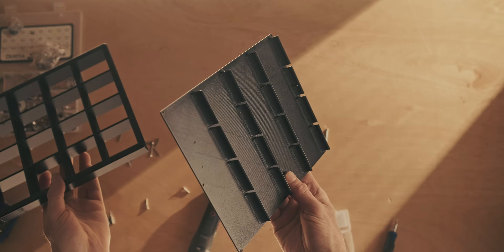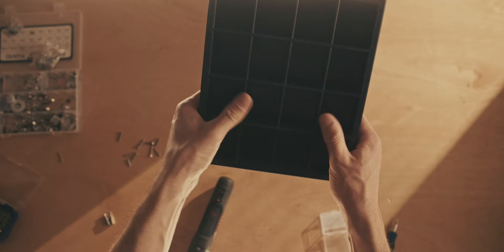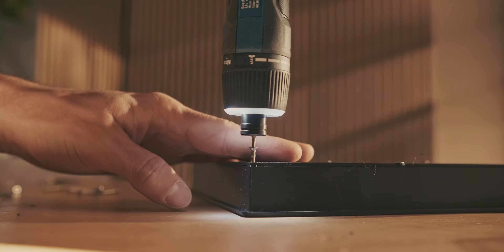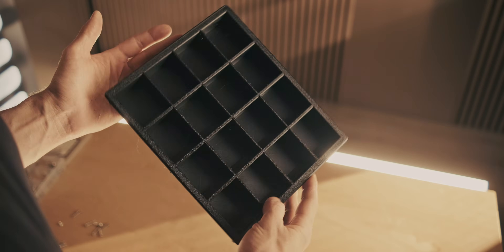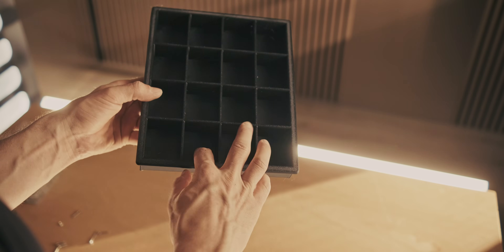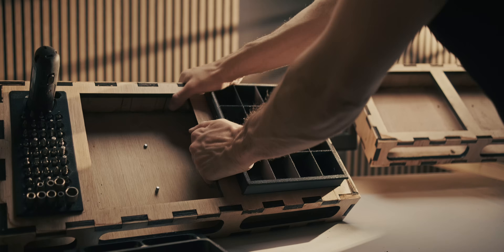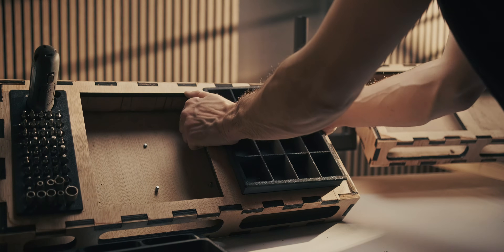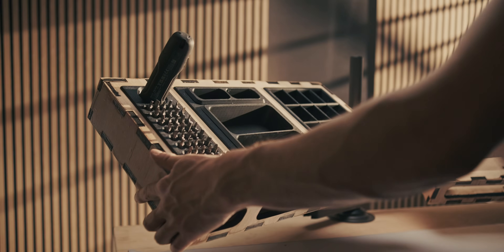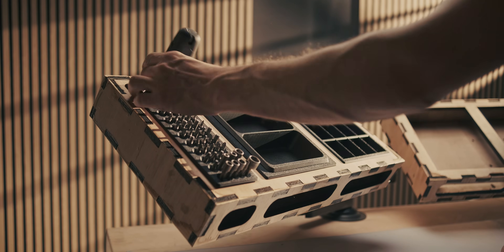Two components: a bottom plate and a top plate. The bottom plate actually accounts for a round-over so you can grab the bolts a little bit easier. In hindsight, it might also have been worth it to mark all of the drawers — drawer one, two, three, four, and so on — so that we can remember which bolts came from which component. But we'll see how this works out, and if it doesn't we can always re-utilise it for something different. For this last panel, I also increased the width of all the edges so that it would be friction fit in the design itself, because most of these panels aren't held in place by anything. I thought I'd use glue, but then you can't replace them easily, so friction fit works out quite nicely — and I'm going to do this for all of the other panels going forward.